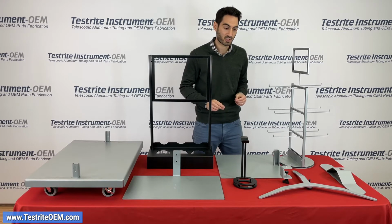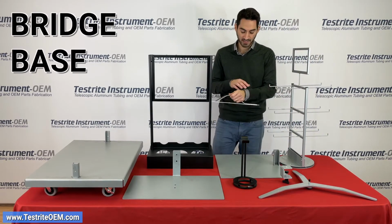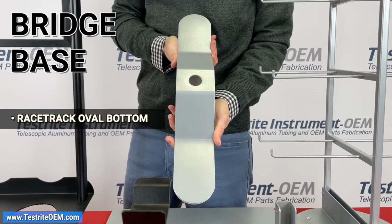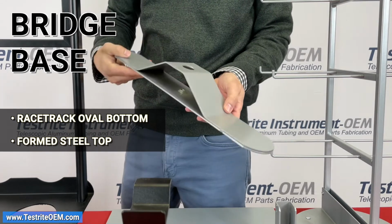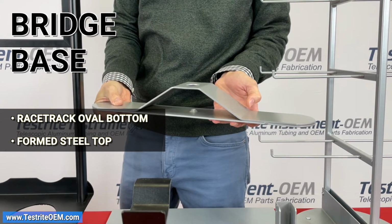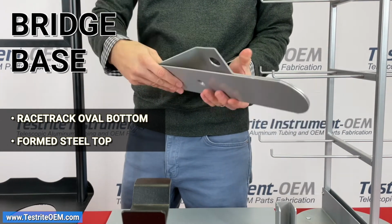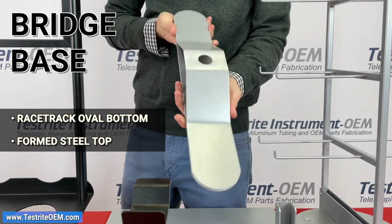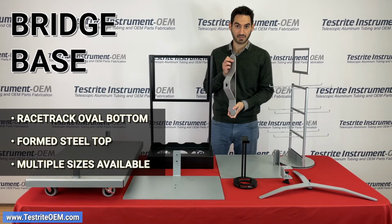The first thing I'm going to show you is our bridge base. Our bridge base includes a racetrack oval bottom with a formed steel top, and these two pieces are welded together. What's the advantage here? You're not only holding the upright, in this case, from the bottom, but you're also providing some stability a few inches up. So we call this a bridge base, and we can make this in many different sizes.